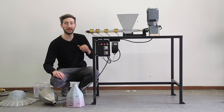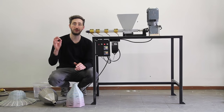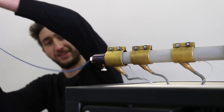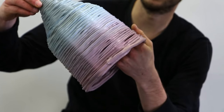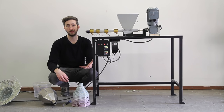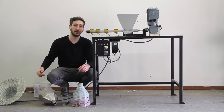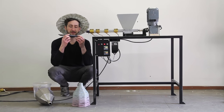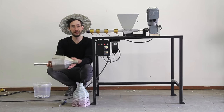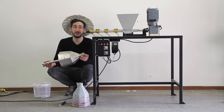In the extrusion machine you can throw in a lot of mixed colors, and the nice thing is that it rotates and blends everything together so you get one nice solid color coming out. For instance, we started off with blue and white and slowly added more red to create nice gradients. You can use it to create new raw material — you could chop it and turn it into new granulate, use it to weave something new like a hat, spin it around tools to create handlebars, or get really creative and put a mold under it. With just a single line of plastic you can do a whole lot.